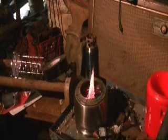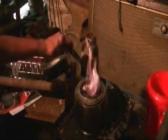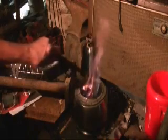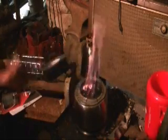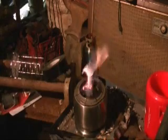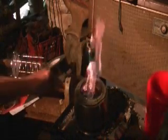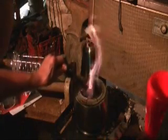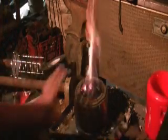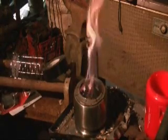I'm going to shut this off and we'll turn it back on again as it gets deeper into the fire. I don't know if you can see it, but right here and right there — these jets, and here's another one over here — are producing a blue hot flame. So they're working. I think they could be a little bit bigger. Down here in the middle, where the tip of the knife is, there is no flame in there. As I disturb it I can move the flame, but there's no flame in there, which means what's burning up here on top is the secondary gas flame. And hopefully you can see how absolutely blue hot that is.